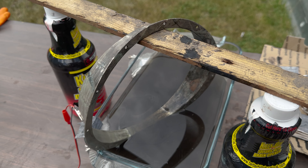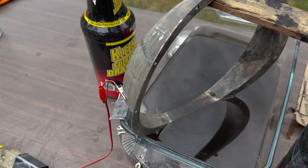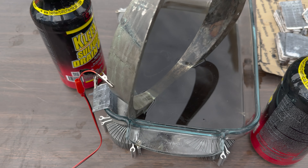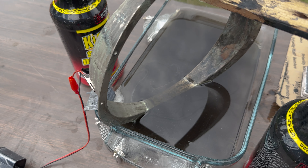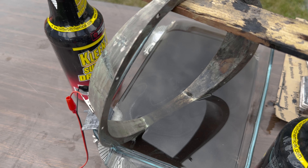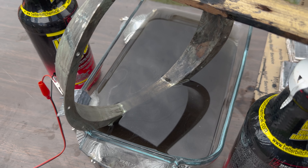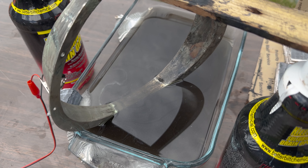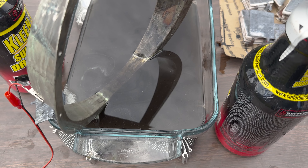We'll pick this up probably tomorrow or the day after. There's the actual reverse electroplating in action — that last quarter took me like five minutes now that I've got the clips out of the liquid. I can't imagine exactly what happened, but those clips were more fragile and susceptible to the process than I expected, and the process completely stopped once the clips got wet. If anybody is following along: this is highly corrosive sulfuric acid — it's dangerous. Wear eye protection for sure, hand protection is good, and don't wear clothes you don't mind having holes in because the sulfuric will eat through them.